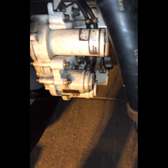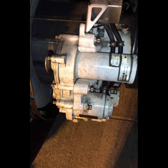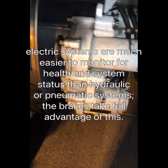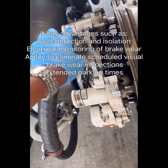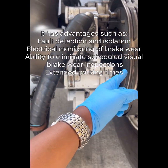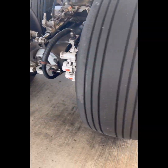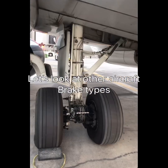For this electrical brake unit, you've got big power electrical cables as opposed to hydraulic pipes and lines. One major advantage is that there are no hydraulic leaks — that's one major issue with hydraulic actuator brakes, as hydraulic leaks on hot brakes increase the risk of fire since hydraulic fluid is flammable. With electrical brakes, there are no hydraulic leaks. Also, there are four independent electrical brake actuators, so if one is inoperative the aircraft can still be dispatched. There's also the obvious advantage of weight reduction from eliminating hydraulic pipes.